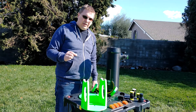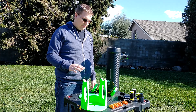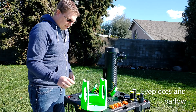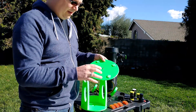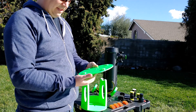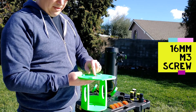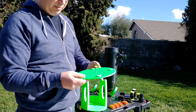The first thing you need to do is print the mount parts for the Dobsonian mount. For the telescope, all you need is the optical tube and the lenses that came with it. We have a base plate — this is what the whole mount rests on. It's a thin piece of plastic with a hole in the middle. Through that hole we put the medium-sized screw (link in the description for sizes). A washer and nut hold that screw in place so it doesn't move around — lock it in place.